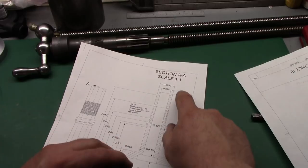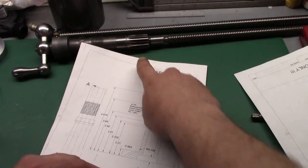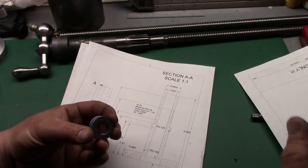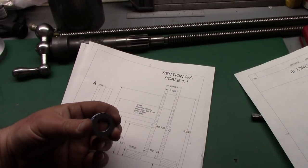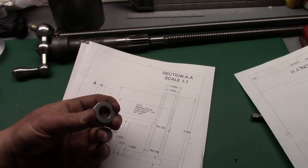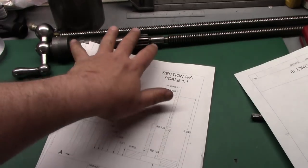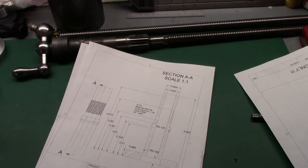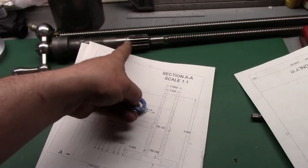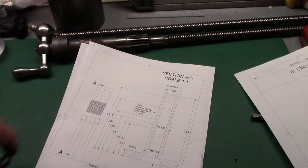South Bend used a proprietary bearing right at the edge that touches the spline — it can be had, but I found posts on online forums where someone special-ordered it from Motion Industries for $75. Since we're going to have to modify this screw anyway, we're going to use a half-inch shaft with a half-inch bearing whose outside diameter is 15/16ths, so it fits right down that hole.